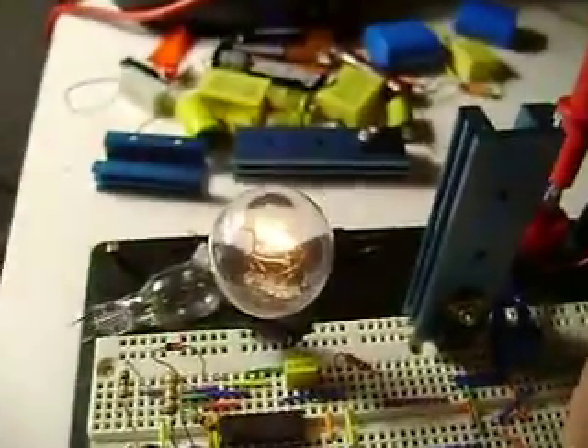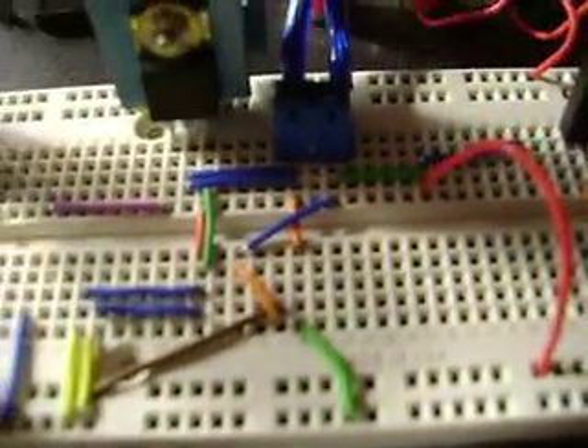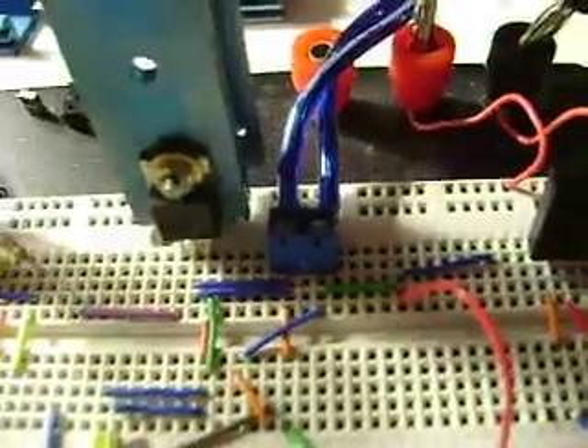Okay, so the resonance cap helps there. This one, when I put the cap in, actually goes down a little bit. I'm not really worried about that. Take this off — I have little crisscrosses there. I had to get rid of those — those are probably a bunch of resistance coming from that side of the coil. The green one and the red one go down to here. I'm running these two, one on each leg in opposite directions instead of catching. I just want to see what the DC component would be, without collecting the other half, but I'm just showing results I got so far. And then this bottom side here goes to that orange wire, which is on this side. So the diode is just pulling one half of basically the back pulse from the coil.